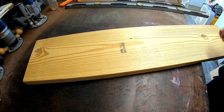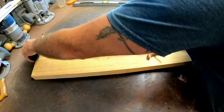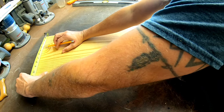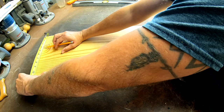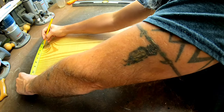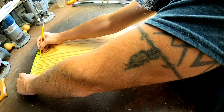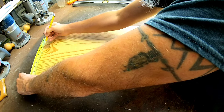Normally I would come across and make a mark at four, five, and six and a quarter. But on this board that knot is right on the edge of four, so I want to try to get as much of that knot out as I can. I'm actually going to come over a quarter inch more on all these, just so I miss that knot.